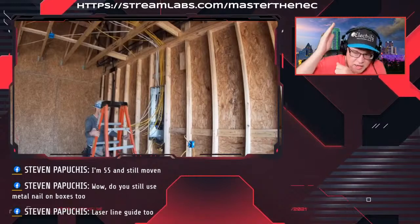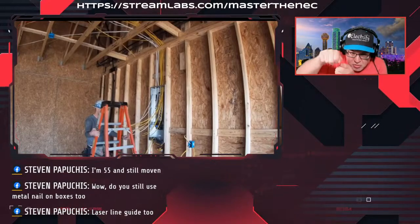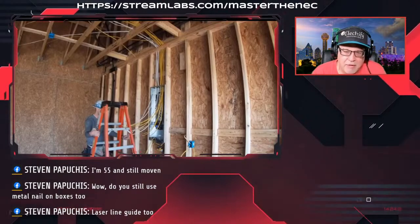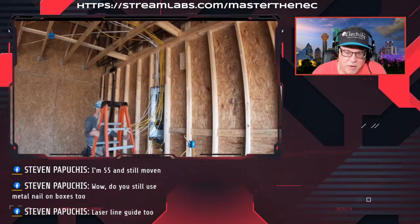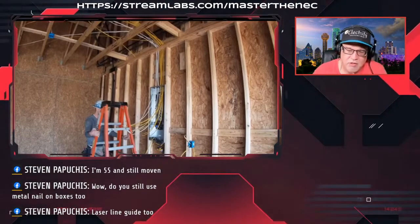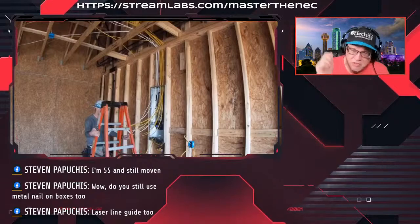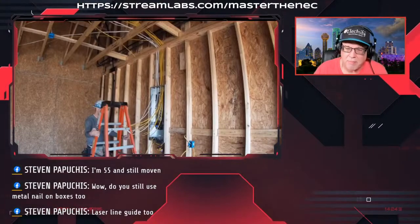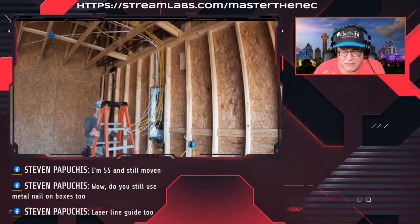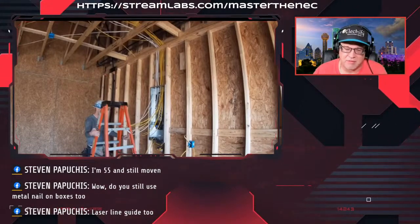Well, what they were doing is putting cuts in the insulation, and they literally were cutting it all the way down to the conductor because they couldn't control the pressure. They're just in there trying to get the sheathing off and cut the paper. What was happening is they would create micro cuts in the insulation, and depending on its proximity, it was causing problems creating arcs. Depending, it was a load intensive issue maybe on that circuit. But when I started analyzing it, they were actually damaging the insulation. Now, the majority of the time it's probably really thin cuts on the other side of an equipment ground and not an issue. But I did run into an issue and identified that they shouldn't be stripping their boxes like that.